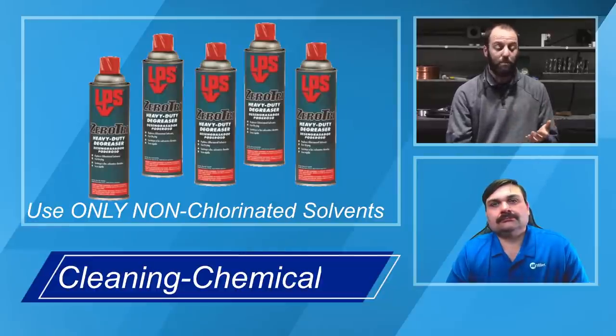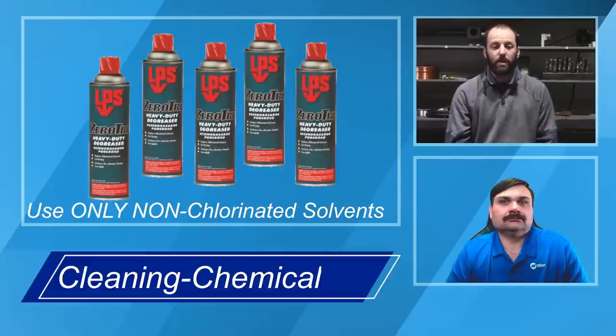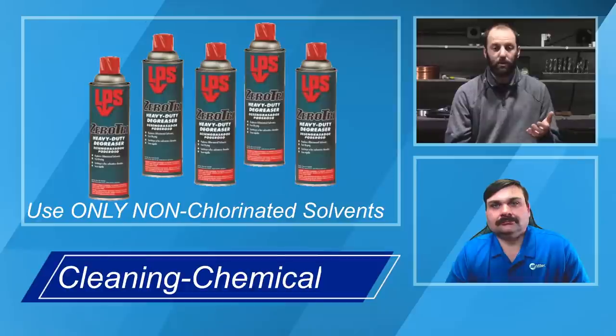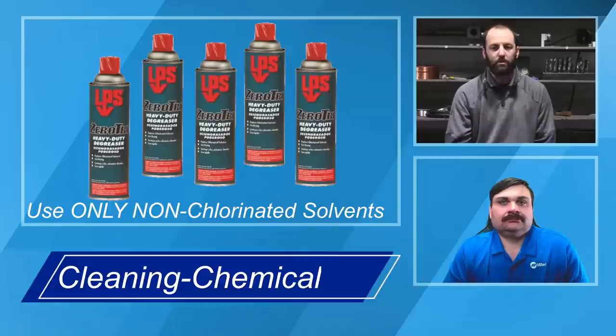And then the next step behind that is wire brushing. Some of the materials that we don't want to be using: I've seen people use things like window cleaner to try to wipe away the solvent. And really it's a water-based solution, and it's not going to dissolve and help bring that material adequately up to the surface, or it's going to deposit its own residue, which is then going to end up in the weld when we try to strike an arc on it.